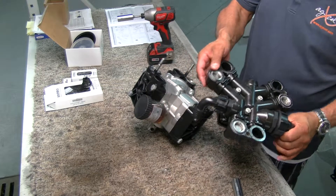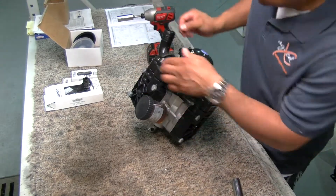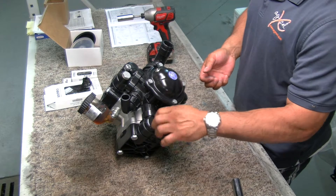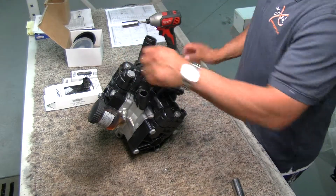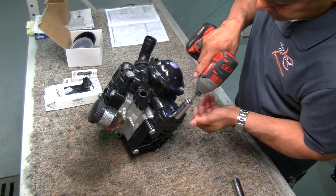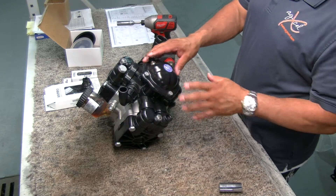Press down on the O-rings. Once that's set, take the head, find that bolt pattern once again, and you can just gently put it in. You'll tell immediately once it's set — everything looks good. If something's not fitting right, you're not going to get a good snug fit. Get your nuts and hand tighten these first so that you don't strip it out. Make sure you're on the thread, then go back in and tighten this back up — tight is tight. Now that we have these tightened up, we're going to check and/or replace the air diaphragm that we use to help stabilize the liquid.